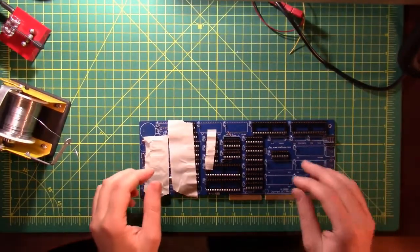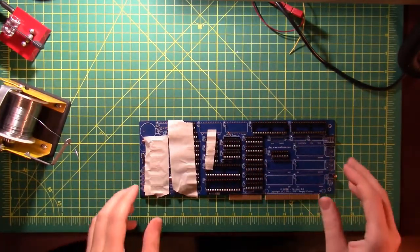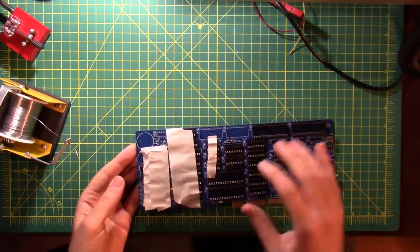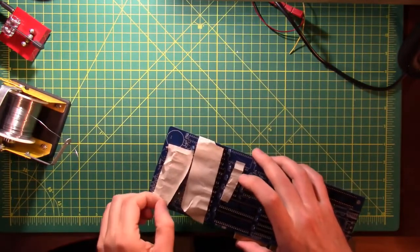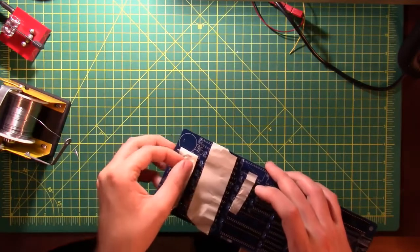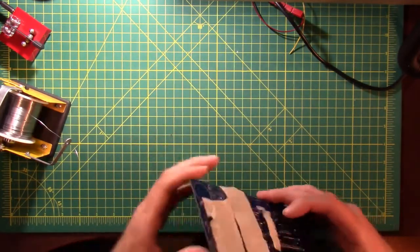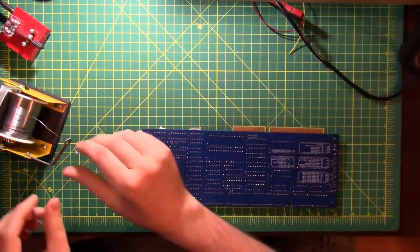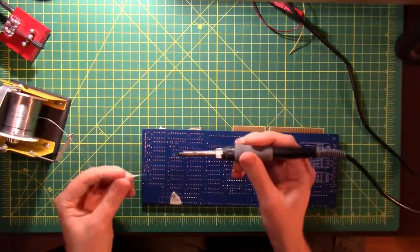Okay, so I did a little bit of housekeeping, and I got out the next set of sockets, and there are 16 of these guys, so I'm going to use the other trick, where you put them in place and you tape them in and double check them all before you flip the board over and solder them all in place. And what I'm going to do is solder one of the pins on each one of these in place, and then I'm going to flip it over and take the tape off and laugh as I realize I missed one of them